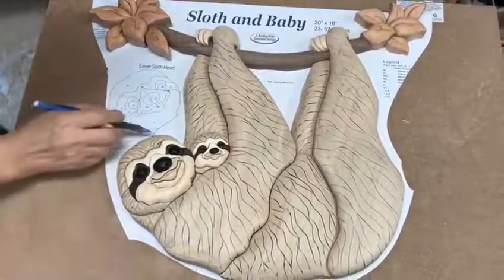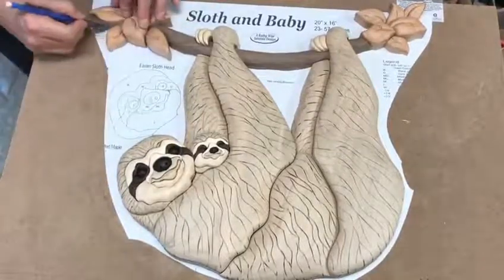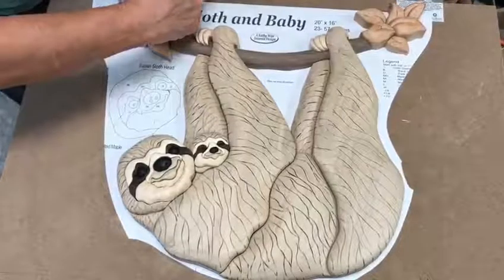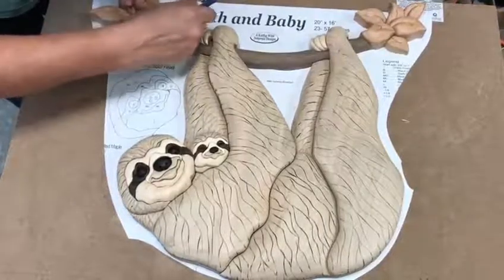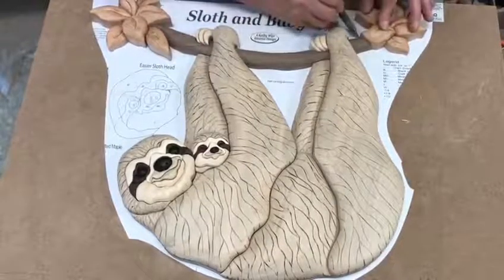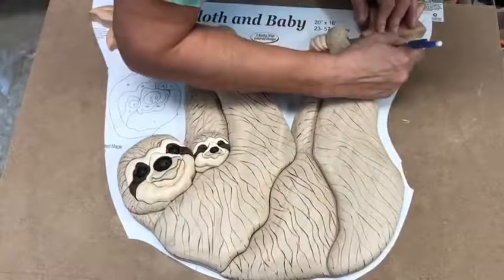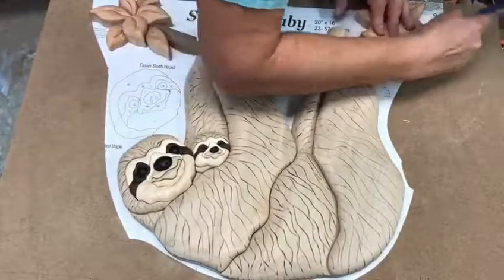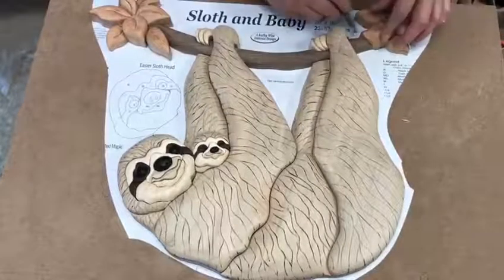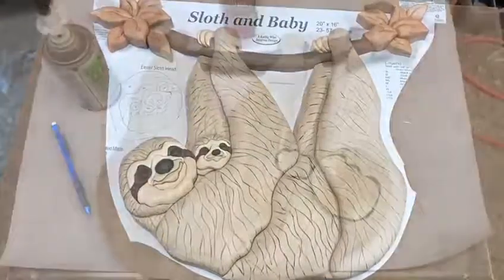You want to retrace your lines in case you're off a little bit, especially on the leaves — they might have changed just a little bit after gluing. So trace your new line. This is why I never cut out the backer boards until after the whole project is glued together. If I had cut it according to the pattern it would have been off quite a bit. I'm going to cut just inside this line about an eighth of an inch.